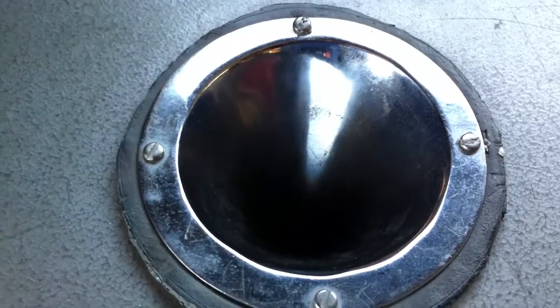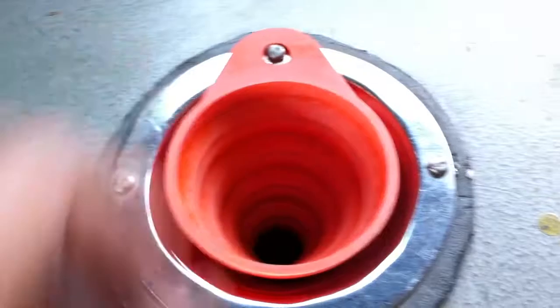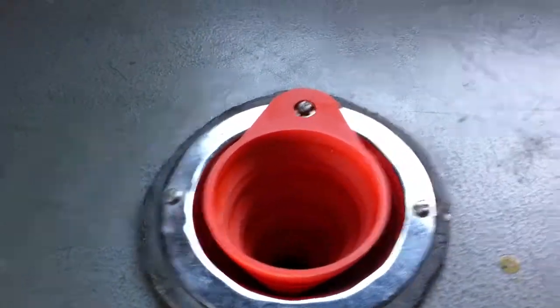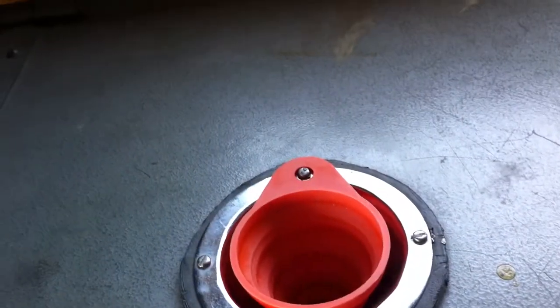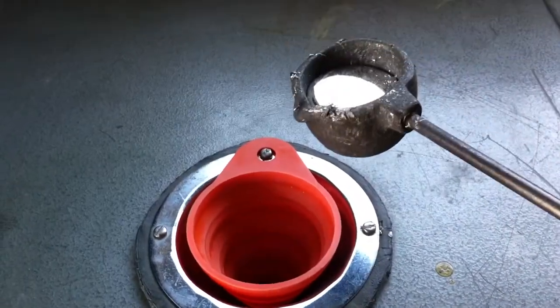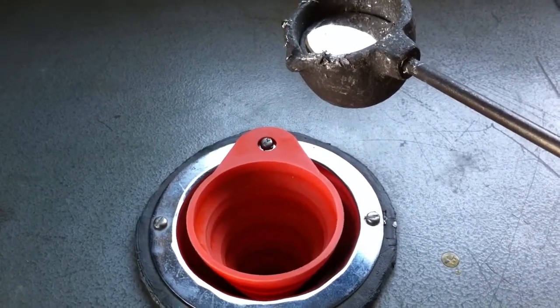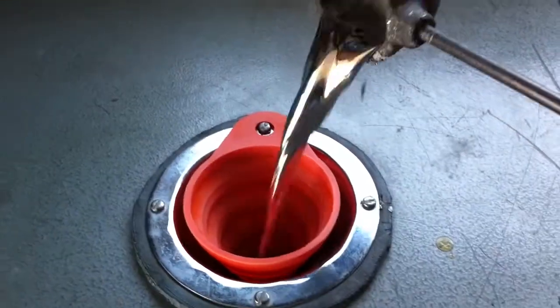What I do is just put the silicone one in there and turn the machine on. There's a mould in there already, lovely and pre-warmed. With the funnel in place I can actually increase my drop height because it will guide the metal down into the mould far more, and it won't have metal sticking to the metal funnel. So we drop it in.